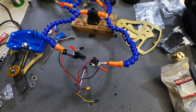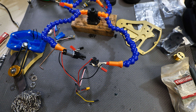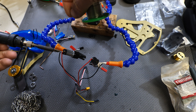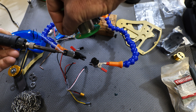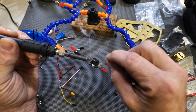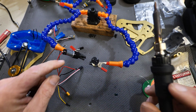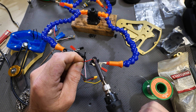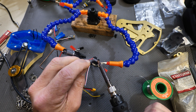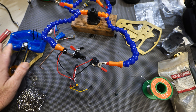This section is dedicated to Red Wire Robotics — Chris, I know you love my soldering. It might not be pretty, but it doesn't come undone. Trying to solder behind a camera takes it to a whole other level. Be quick with these connectors; you don't want to get them so hot that you ruin the motor. We'll tin our tabs — the actual wires are already tinned — and then hold them in place and solder them on. Just like that, our motor wires are all soldered on and ready to be installed.